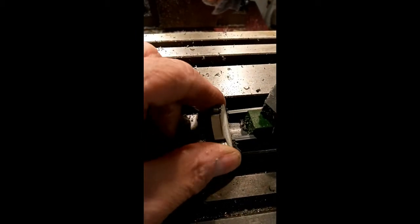And we've just machined all that away now and just kissed the bottom. So that will then allow this part here, which I'll just drop in so you can see. Let me just wind the head up out of the way. Right, that then allows this part to go into that position there. And we will super glue that in.